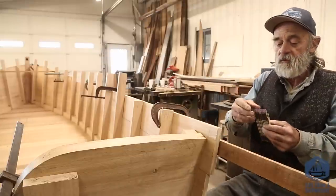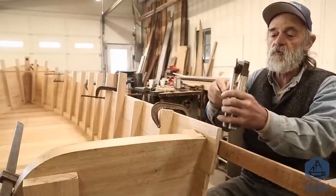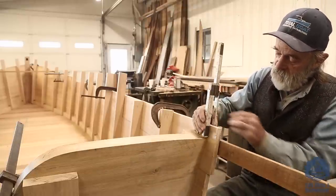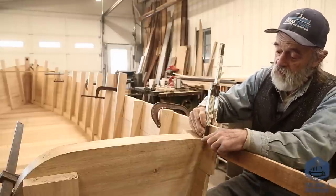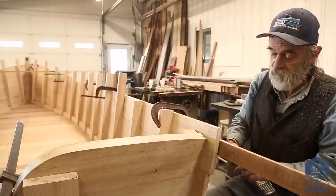The way I did that is I just took a folding rule and folded out a couple of folds like this. What I do is I just put the rule on there like that and squeeze it down nice and tight on the inside, then make my mark on the outside - and that's how I got the height of the transom to the outside, and that's where I started my shear line right there.